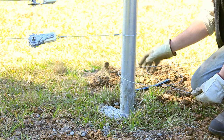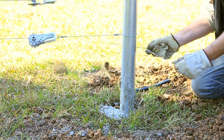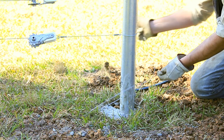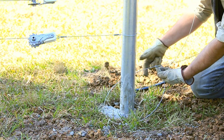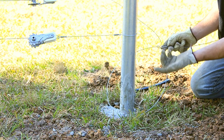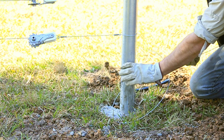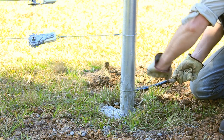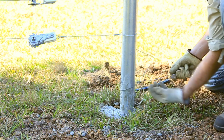I don't need to get it nice and tight close to the post at this stage. What I need to do is make sure I've got about a foot, a foot and a half of spare wire out this side. Then when I kink here — this is the first kink, right there — we want to kink that nice and tight around our main wire. Then this one's going to come up and over. So we end up with our main wire coming in around the post, we go under the main wire, over and through the loop, and then we come out and back over the main wire. That's the crux to the knot — it's coming under itself and then back over the main wire. Because we haven't pulled it tight around the post or insulator, it means we can now slide that up and get it nice and tight.